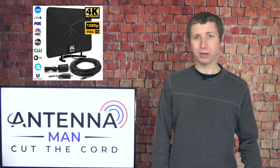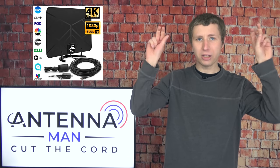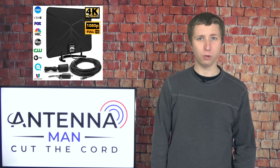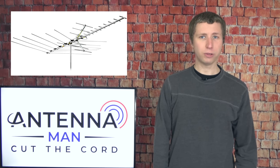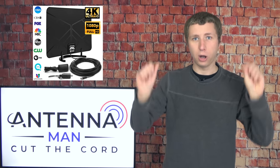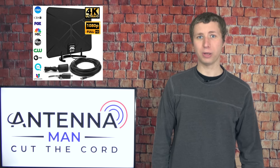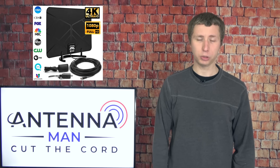One of the first things I have to bring up is that there's no such thing as an HD antenna. The whole HD digital thing came from the digital transition of 2009. There is a lot of misinformation about TV signals, including the myth that you need a special antenna to pick up HD frequencies. The reality is that an antenna is an antenna — it doesn't matter if the signal is analog or digital. HD and digital are just keywords antenna companies use to improve their online search results, which also confuses people into thinking they're buying a special antenna, when in reality they might be buying a piece of junk.